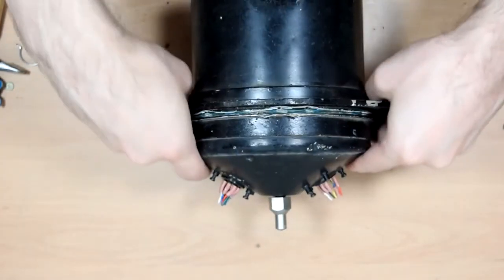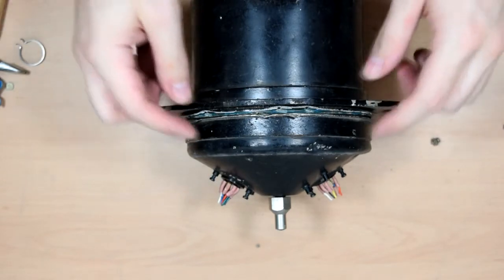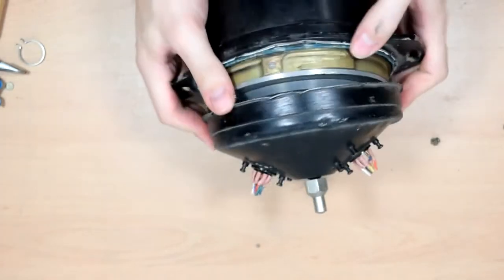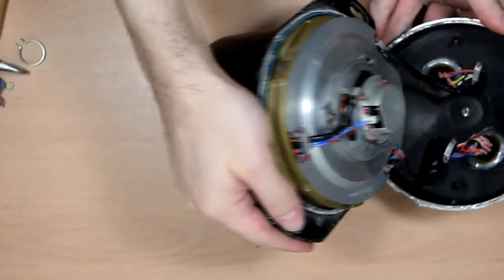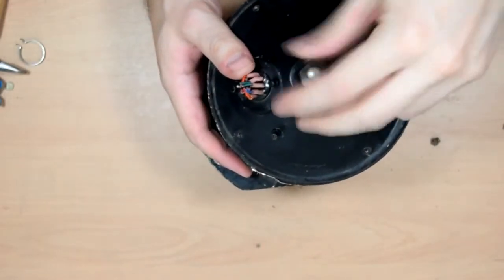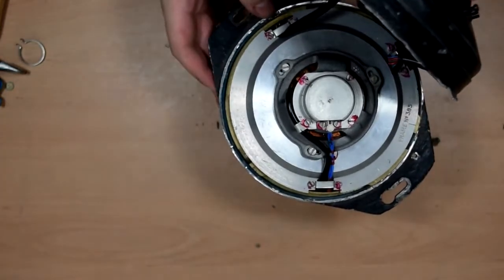It was actually fairly easy. Around this seal they'd run a copper wire and just soldered it in with some high lead content solder. So just exposing one end and grabbing it, I was able to pull the whole thing out. There was a bit of difficulty working out how the top actually came away from the bottom — turns out it rotates along these channels here. This thing on the top I thought was a pivot point, but it's actually a cap for a sealed nipple. It looks like they sealed this and then injected some sort of controlled atmosphere, or perhaps completely evacuated it.